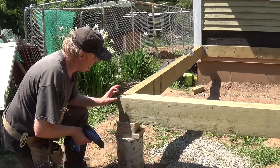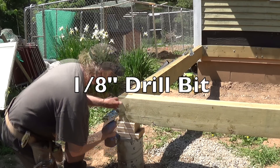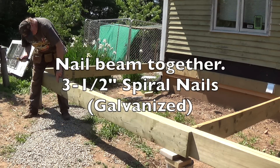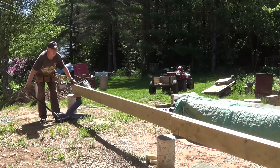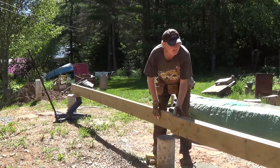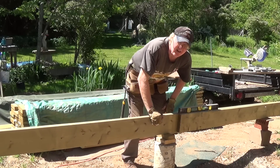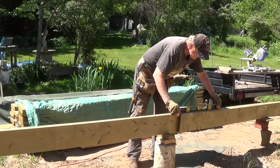Now I like to pre-drill on the ends — it just keeps them from splitting. Now that I've got my joints staggered, all I have to do is just lay in my joint. Okay, 16-foot planks. A jack comes in handy when you're working alone. I'm setting this on temporary blocks until I get everything leveled and squared up. And so far, she's running level.